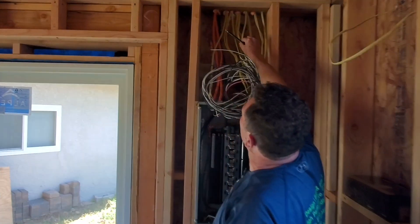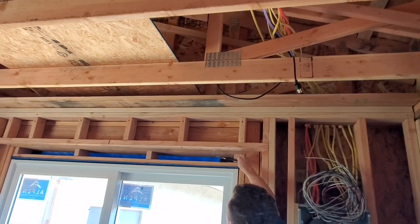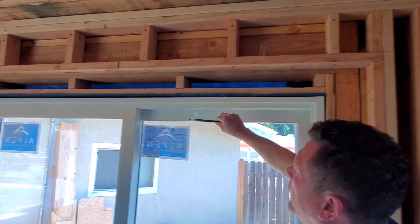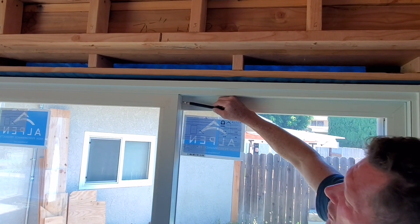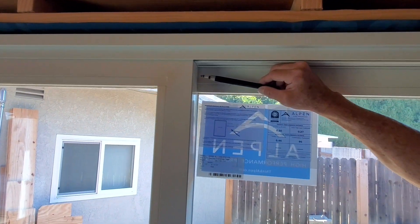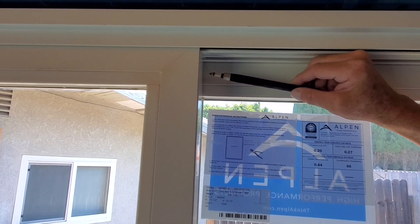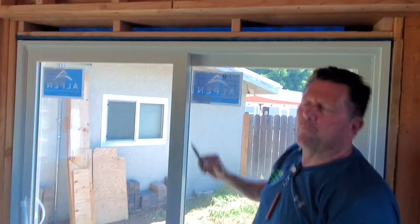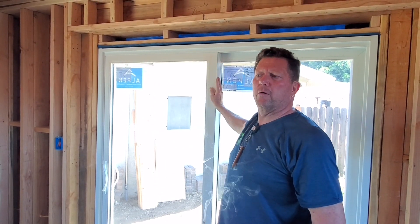This is all part of the inside of the building, so there should be no leakage in here at all. Let's check this slider — most sliders will leak really heavy right here. You can see the smoke disappearing in there. Even though these are passive house sliders, you can still see air leakage, but it's very minimal. Most of the time with a regular window from any other manufacturer here in the United States, this would probably be whistling right now. But we don't hear any whistling — very airtight. Really good job on these windows, and the air-sealing techniques were done properly.